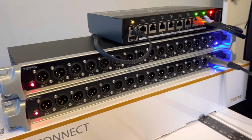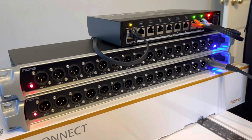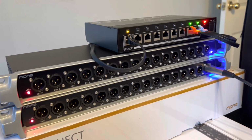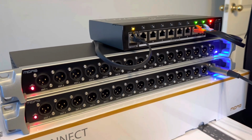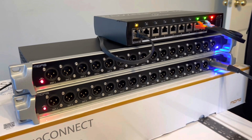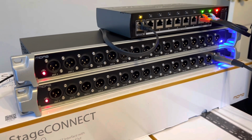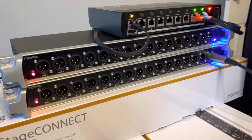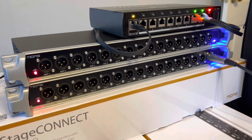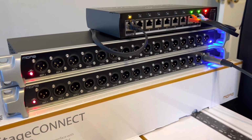So you're probably wondering why we would do this, but this is pretty cool. So you can end up having, essentially, with just using one of these P16Ds, 8 of the Ultranet outputs connected together with the same outputs. So if you wanted to, you could have one channel duplicated quite a bit of times. So this is giving us 32 duplicated channels if we wanted to.